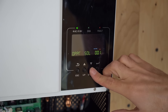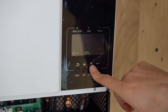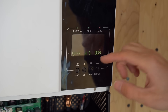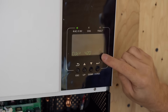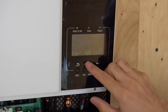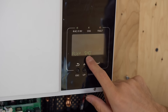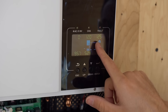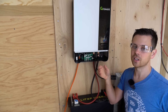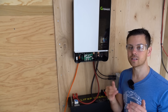Hold down the enter button. For setting number one, change this to SBU, press enter, then go to setting two. 60 amps is good, go down. Setting three — appliance, that's good. Read the manual for your specific system. The most important setting I like to configure is the low voltage disconnect, which is setting number 21, set at 42 volts — when the battery hits 42 volts it will turn off the inverter output. Setting 19 is the charging absorption voltage, 56.4 volts is perfect. Setting 20 is the float voltage, 54 volts, which is totally fine.